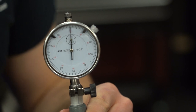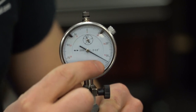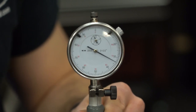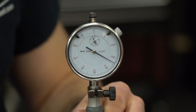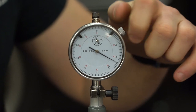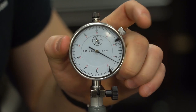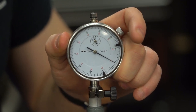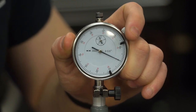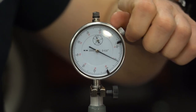Now I'm going to put our bore gauge into the micrometer. When I do that, you see that the needle swings over to that point right there. If I give it a little bit of a wiggle, you can see pretty much where it wants to sit. I'm going to loosen this thumb screw, and when you loosen that, you can spin this bezel around, and you just want to put zero under the needle. Give it a little bit of a wiggle, make sure it's centered up — that looks about right to me — and then you can tighten back down that thumb screw and this thing is zeroed out.